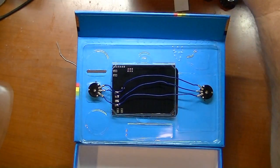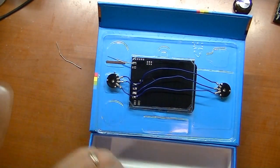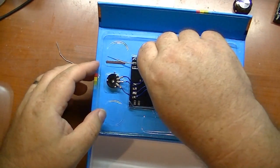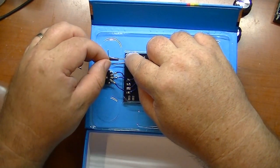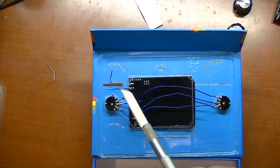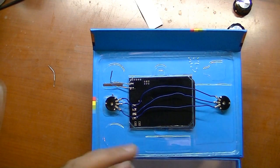There are all the wires soldered in just like the instructions show. Now let's move on to the next step. Next we're going to mount the coin detect circuit. I've already put one right here, and I've punched a hole through the plastic on the sides to hold that wire in place. I just bent this wire up — this goes into the circuit board, just like that one does — pull it through the plastic, then put it on our circuit board and we're going to solder it. That's what's going to detect our coin when we put it through that little slot. I've got the coin contacts soldered in and the wires bent around.